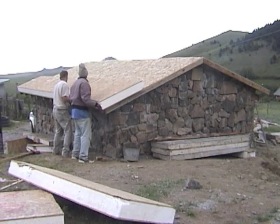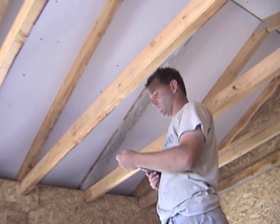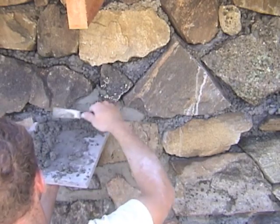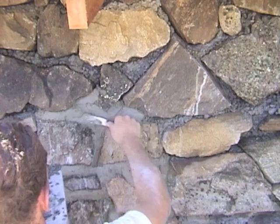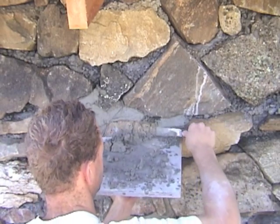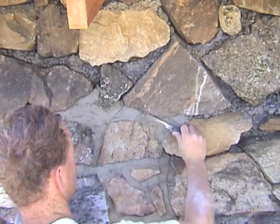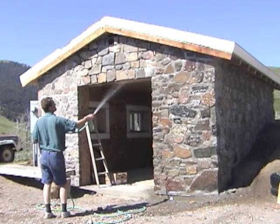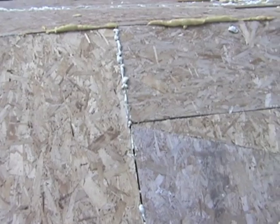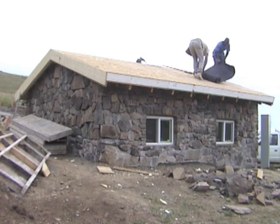Next we insulated the roof, fitting together more scrap panel pieces. We put all the panels on from above then went back and screwed them on from underneath. We use a mortar board consisting of a scrap of plywood with a wooden handle screwed to the bottom and push the mortar into the joints with the aid of a putty knife. I like to empty the mortar board first then go back and smooth out the joints. The grout dries out quickly so be sure to keep it well watered so that it can cure with the greatest strength.